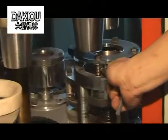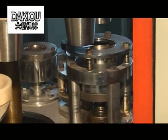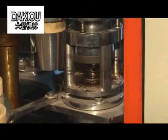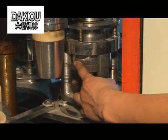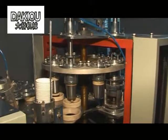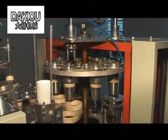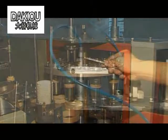If the flange panel lower springs are over tight, change them with 4 new ones with smaller tension. If the cone-shaped die and the flange lower die are not in the central position, adjust the central position of the flange lower die and the cone-shaped die. The above four may cause the problem of wrinkle or release.